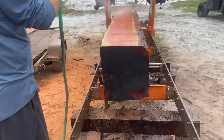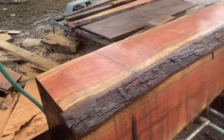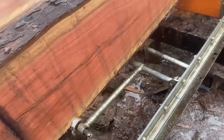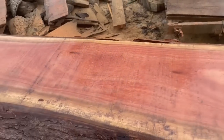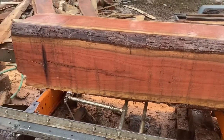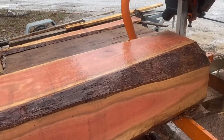Now we got a great big beam - a big old cant of eucalyptus. I'm just going to make them two inches thick, going down the log. I chose this side to go down because this side has cracks in it, and I wouldn't really want the cracks in the top of the boards. Now it might crack when it's drying a little bit on the ends, but you know, it's just the luck of it. Thankfully this is nine feet, and it's always good to leave your log extra long. That way when they do crack, you can trim it down and get an eight-foot tabletop or something like that. If you want a 10-foot table, make it 11 or 11.5 feet, and then you can trim off the ends when you get to working with it after it's dry.